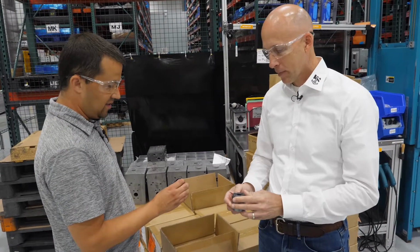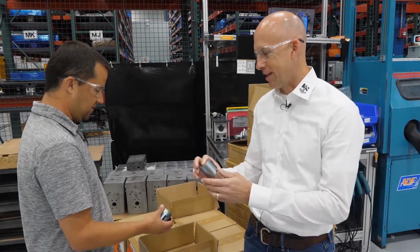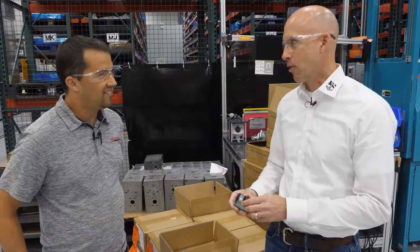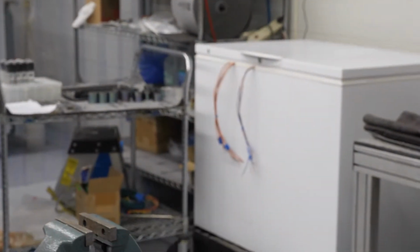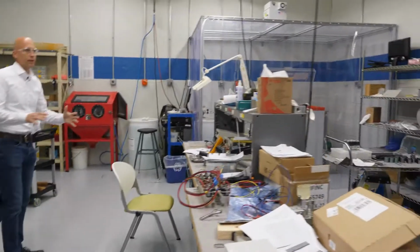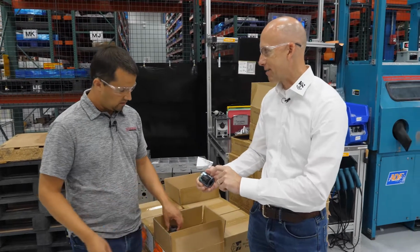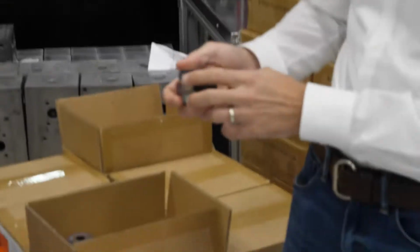The biggest fear for a lot of people going to electro hydraulics is that these coils will fail, right? That they're fragile, right? But we spent a lot of time developing these so that they don't break. So in our lab, you're going to see ovens and freezers and a big chamber where we salt spray test these things. The thing that causes a coil to fail is water gets inside, and there's a copper winding in here, and that copper winding gets moisture in there, and then it just rusts or has a short circuit.